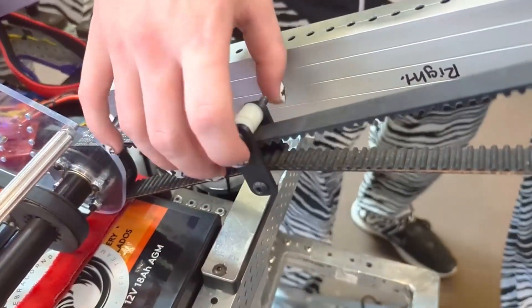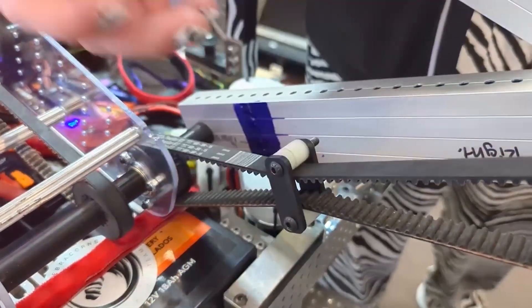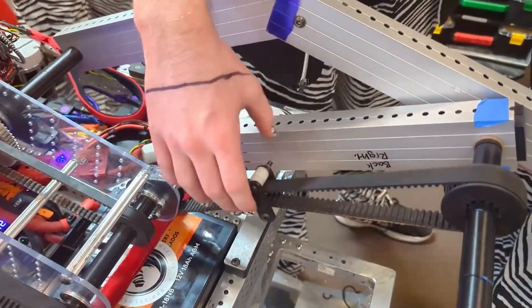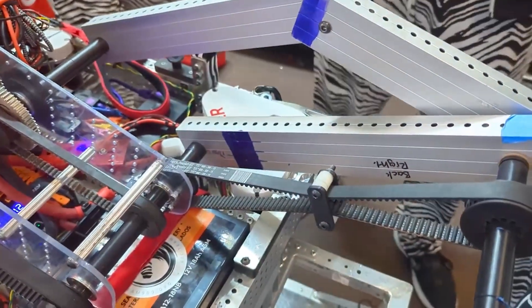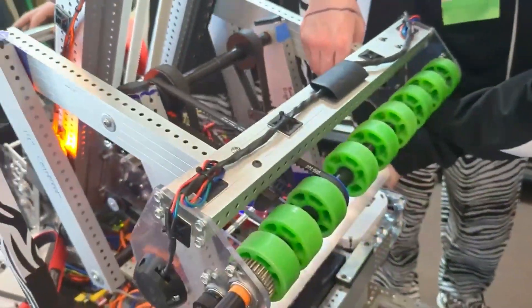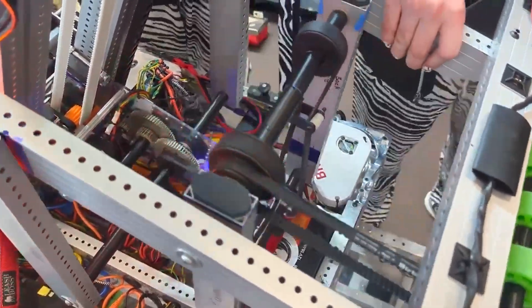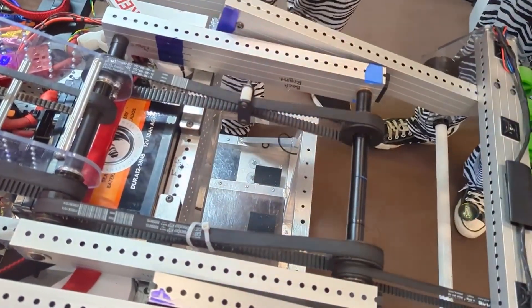These tensioners are something we've developed as a team a while back. It is a 3D-printed piece with some Delrin spacers and a number 8 bolt going through here. This way we can get really good tension — if you flick it, it hardly moves. The important thing is it can also move up and down throughout a match. If we tried a static spacer, the tensioning force would get either too great or too loose as we moved. By putting it on both sides and allowing that freedom of movement, we get really good tension through all of our positions on the four-bar.